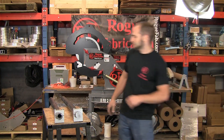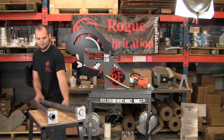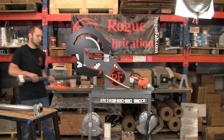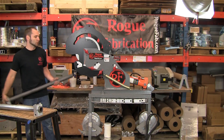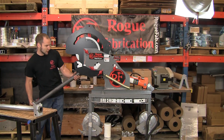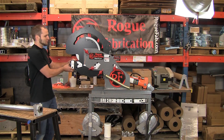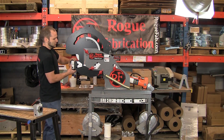Today we're going to bend some tubing. We'll start with the bar. I've already attached the clamp blocks to the machine, just to make it easier to load it. One nice feature of our dies with separate clamp blocks is you can pre-clamp a bunch of material, be able to make repeat parts, or production, or whatever else you'd like to do with that.